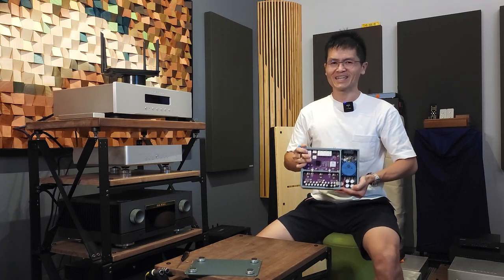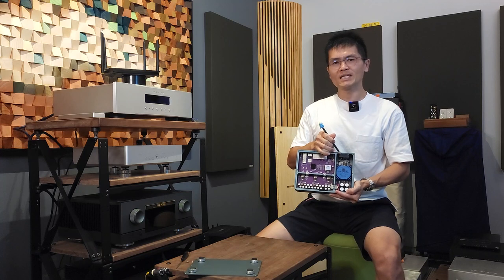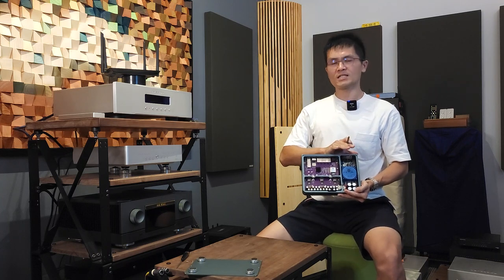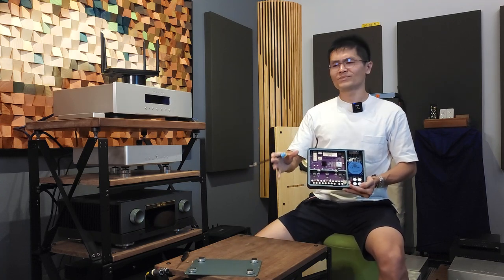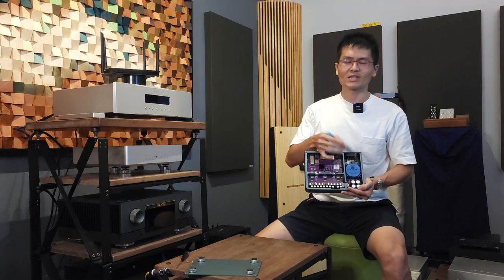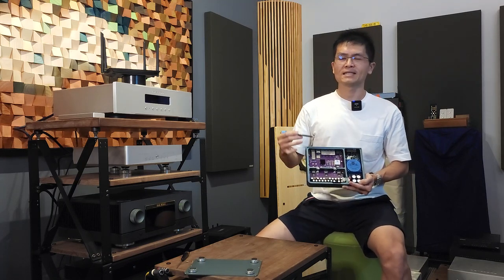It's pretty lightweight — I can carry it with one hand. AC inlet comes in from the power cord, there's an EMI filter to filter the AC, then a Talema step-down transformer to step down 120V or 240V to a smaller AC. There's rectifier circuitry to rectify the AC to DC. This is how a linear power supply works — there's always a transformer (encapsulated, E-core, toroid, or other types), the AC is stepped down, rectified to DC.